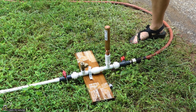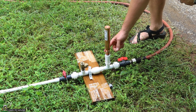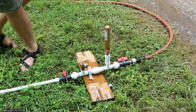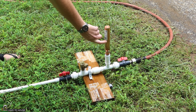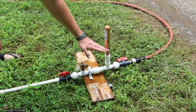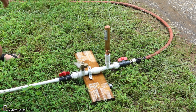First I'm going to open this back up. It's going to push water from the delivery pipe back into this system, so hopefully it will start cycling immediately once I open this. The pump is working with this arrestor on here and it doesn't seem to be hitting hard. With every cycle it's jumping up and down a little bit and sending water up the hill.